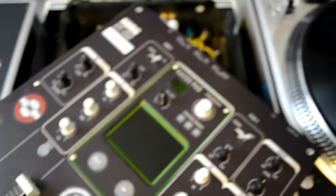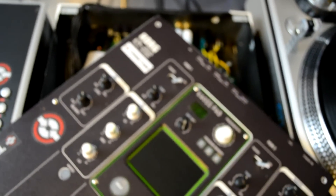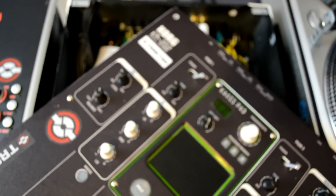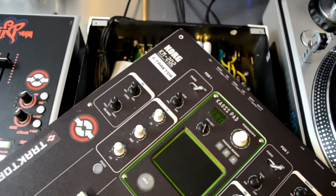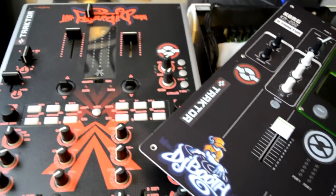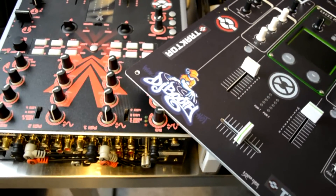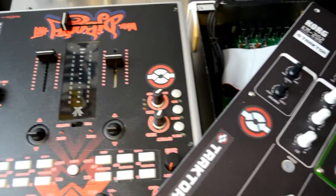You've got to get good spacing and make sure it all fits — this was a very tight fit on the Vestax, not so much on the Korg. There are a lot of mixers you can do this with. Just study the rear of the mixer and the height of everything. You may also have to move around some boards and disassemble your audio card to a certain extent. But it's the price to pay if you really want to make your mixer Traktor-ready or Serato-ready. You can also do this with the SL1, the SL2 — anything that is USB-powered as a DJ sound card.